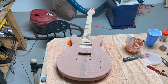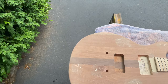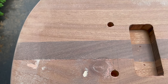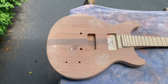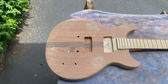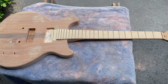As this video continues on, we'll be able to see if that was a good idea or not. The random orbital sander made quick work, along with a little bit of hand sanding in some of the tighter areas. Where you can really see the impact is if you look at the walnut strip — you can see the little pink streaks in there, and that's the grain filler filling up the grain. By doing this now, when I go to do a coat of sanding sealer, it'll take fewer coats of the nitrocellulose lacquer paint and clear coat, so I don't have a situation like I did on my great guitar build-off guitar where I ended up using two cans of clear because the finish was sinking in.